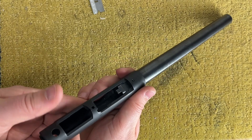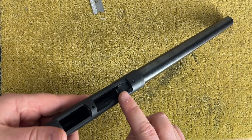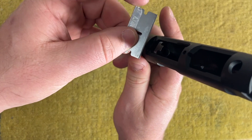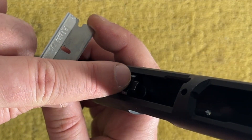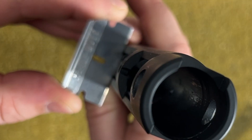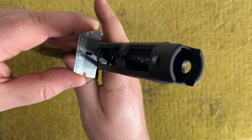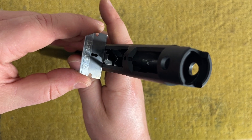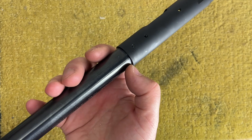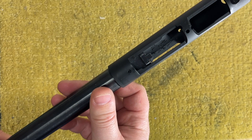Back at the workbench, you can see what I meant by this. This whole area here — it's not quite flat, because there's actually a tiny gap between the flat section here and the flats of the receiver. But they should be parallel to one another, and that gap is minimal. That's what we're looking for. Obviously, we're also looking for the barrel edge to actually butt up against the receiver.